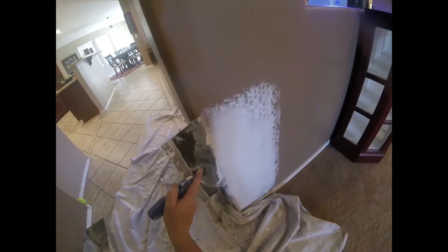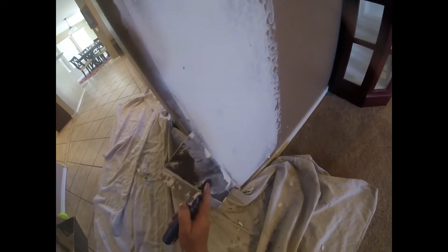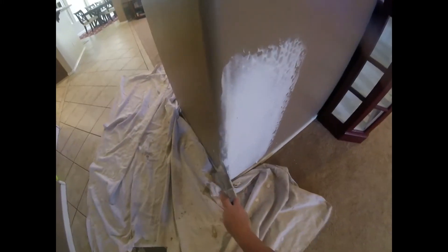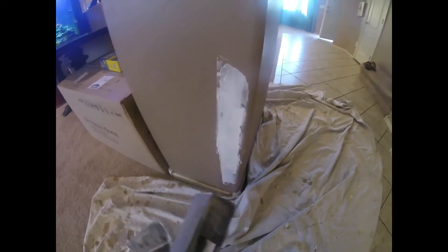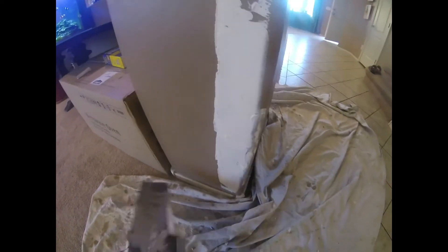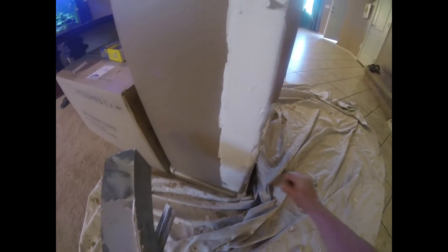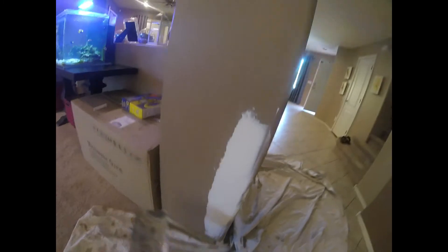There are special round tools you can use, but if you don't have them it's the same thing — just push the knife and fill in the corner. Basically it's like working bondo on a car; we're just filling in the dents. Same principle with drywall mud. I guess you'd call it drywall bondo because it's a quick-set five-minute material that sets up quick — it's a strong material. Put a nice healthy first coat and take it around the bullnose.